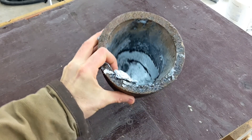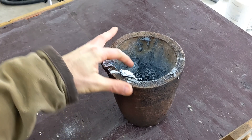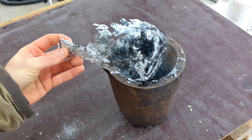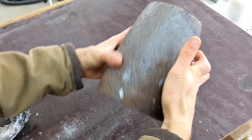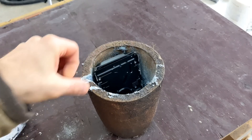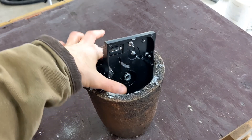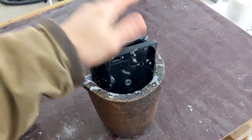Now we're going to load the hard drives into the crucible, but first we need to pull out the slag from my previous melt. It's very easy to remove this the day after once the aluminum has solidified — just basically pull it out. I am using a 12kg crucible and these hard drives fit very well, except for the fourth one. It doesn't quite fit four of them comfortably.